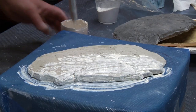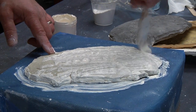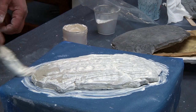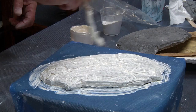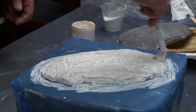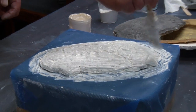We will take the latex with a chip brush and begin brushing in one direction. Latex rubber must dry in between coats. Typically three coats a day can be applied, or up to eight coats in very hot weather. The material is put on very thin — you do not want to put it on too heavy, because a heavy collected area may not dry between layers, which will produce a mold that will rip apart later.